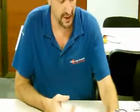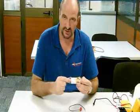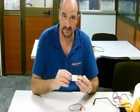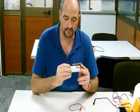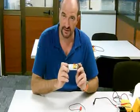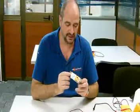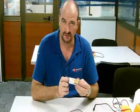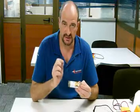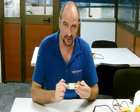Now, points to note is that the PT9 has a lifespan from original installation of the first battery of 6 years. That is for the beacon, but the battery itself only lasts for 3 years. So in the lifespan of the PT9 beacon complete, you will have 2 batteries installed. The one at the manufacturer's and the second one within 3 years from that date as specified on the side.